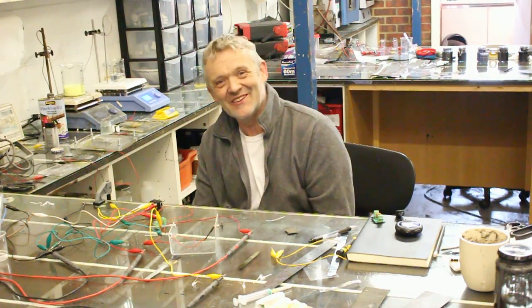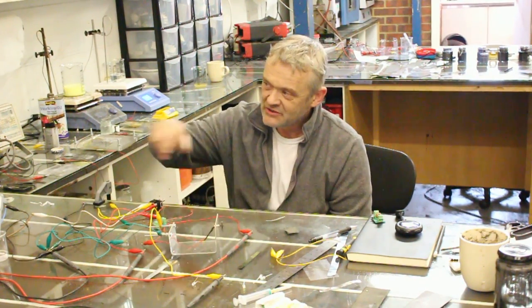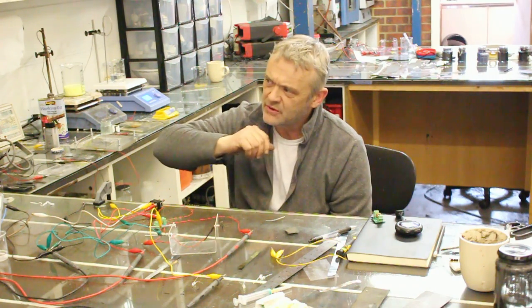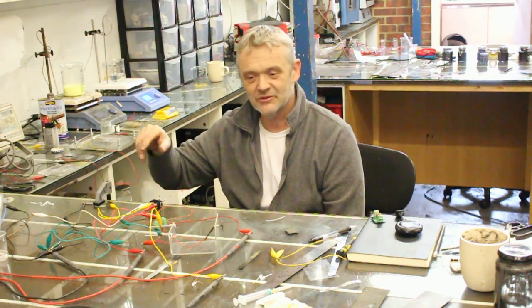Hi, so it's a little update on the cell. We're back on the bench with one centimeter square cells. That's what's under here and of course it's running the motor. It's running the motor at about 22-23 milliamps at the moment, dropping down to about 173 millivolts.